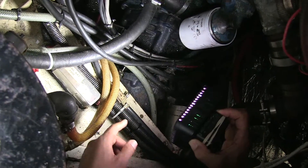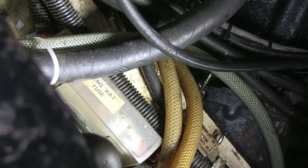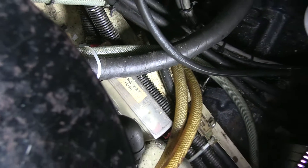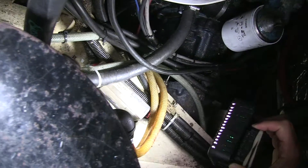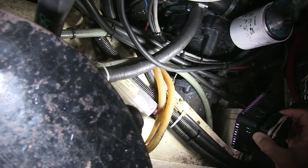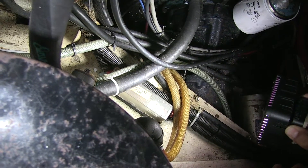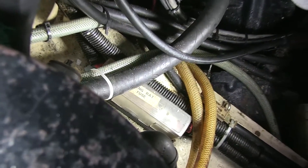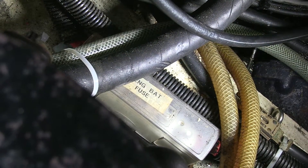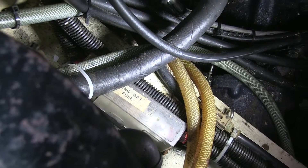Here we've got an engine battery fuse holder with a spare fuse, which is great. You don't have to put a fuse on an engine battery, but if you're confident in your starter's draw you can install one. In this case there's a 400A ANL fuse. On a starter circuit, if you're going to use one, you'd want a 2:1 ratio so the engine never causes a nuisance trip. An ANL 400 will allow a large surge of current at multiples of 400A for a very short time.